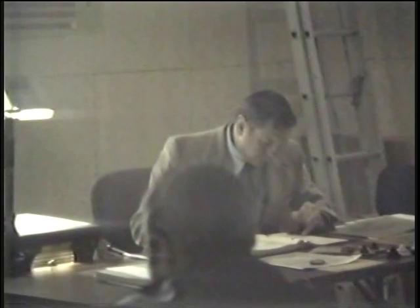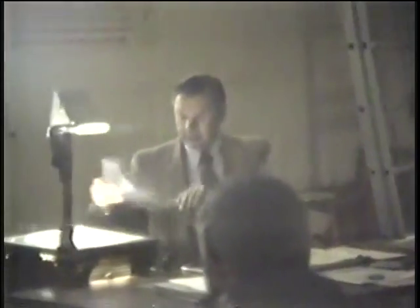Okay? Now the edit switch also functions in the record mode. It disables the comb filter, which is used to remove the chroma from the luminance, as we all know. And by doing this, it prevents severe vertical displacement of chroma in multi-generation editing. What do they mean by that? Anybody want to guess? When you go over these sections twice or three times, you mean?